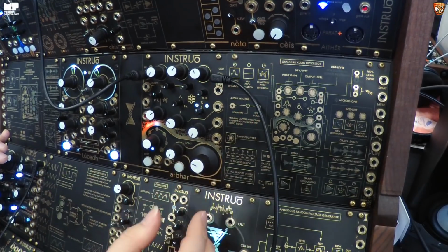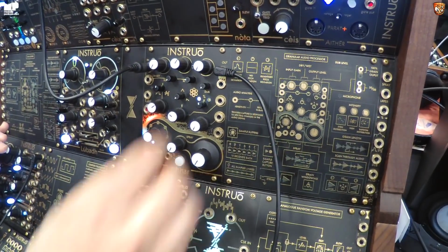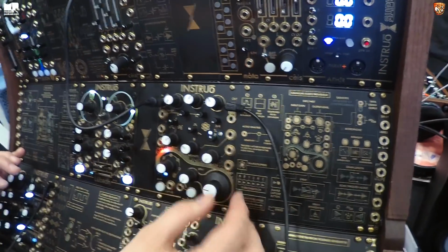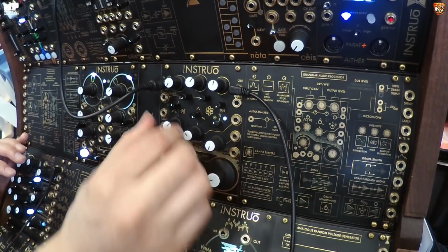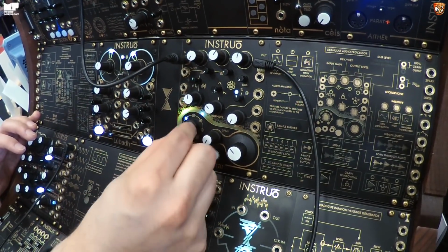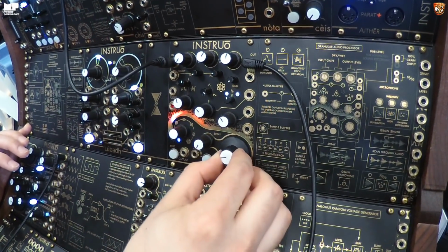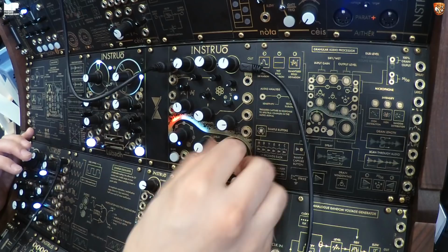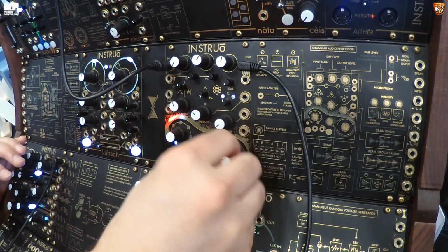Under the hood, to get the most out of it, it's changing to a dedicated wavetable oscillator synth engine. So when you've got there, the texture now becomes a timbre control, so you get smoother zero crossings depending on where you are in the buffer with the Gaussian. Move more aggressive, and that of course tracks volt per octave, and will update based on what layer you're in, or what buffer you're in. Some amazing vocoder-esque sounds going on. Yes, it's extremely vocal. And with CV control over length, you can jump from the scattering grains of audio playback up to synthetic.